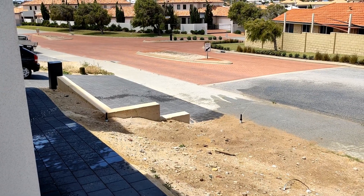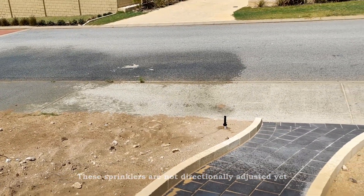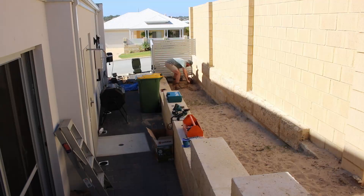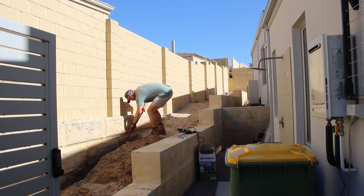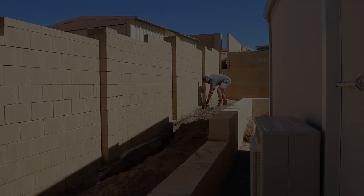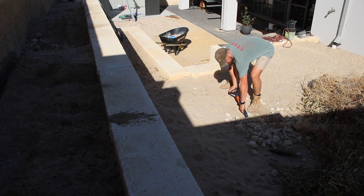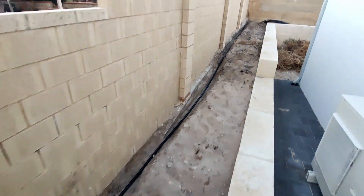First test — success! But only three of the four sprayers are going well, as there wasn't quite enough mains pressure. We'll sort that out later. Back to digging — I'm now trenching up the garden beds towards the back of the property. These beds will be planted, so station two will use sprayers along a 19mm conduit. Right next to that I've got to run a 25mm pipe all the way to the back lawn. The retaining walls weren't backfilled properly by the builders, so I'm taking the opportunity to level them out as best I can — they'll all get filled with soil in the future anyway.